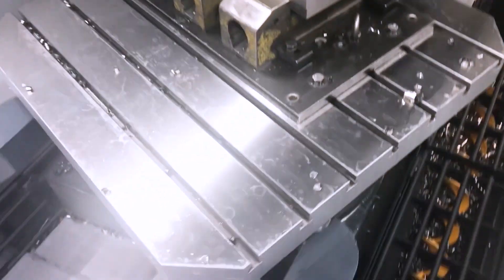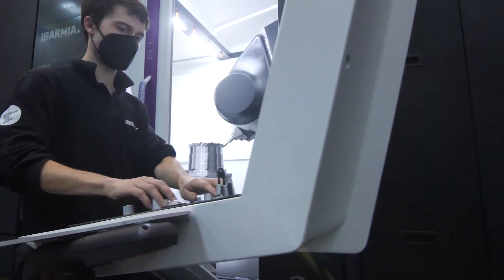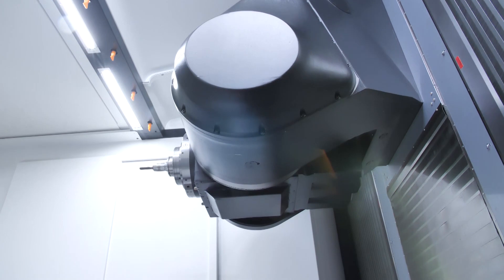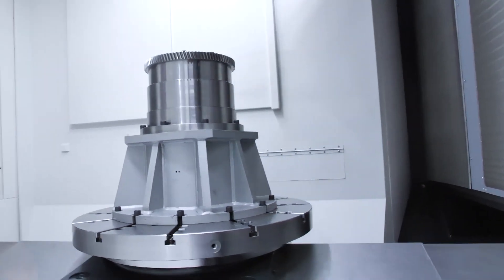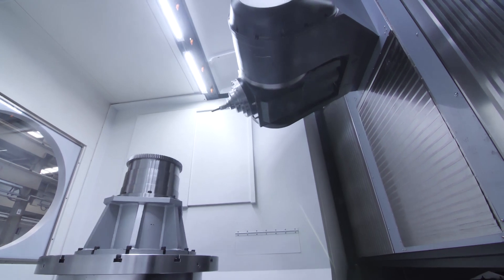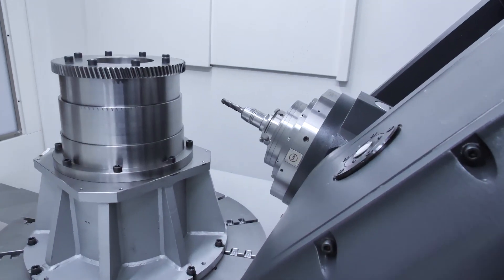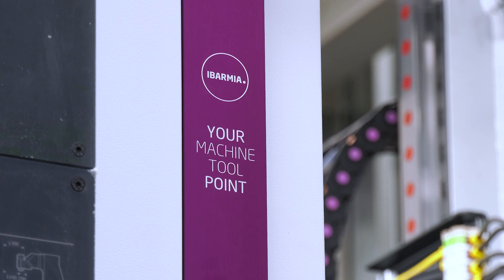On the Multiprocess, you can place two to three tons on the table. We have a direct-drive torque motor that can load up to 2.2 tons as standard, going up to three tons on a turning table that runs up to 500 RPM. On the Xtreme, the table can handle up to six tons on milling operations.